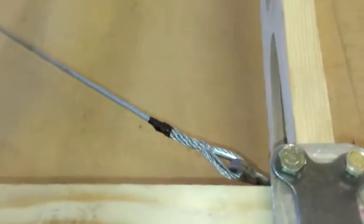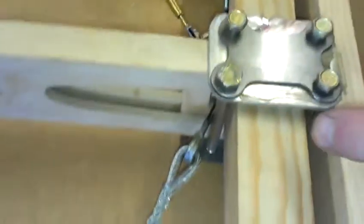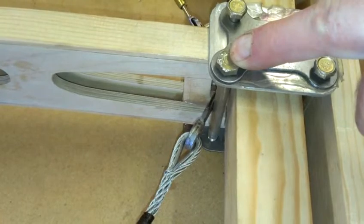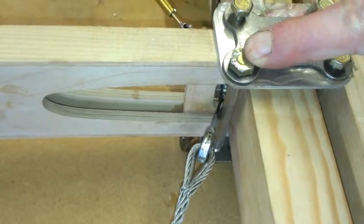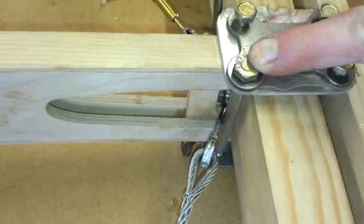The problem is worst on the rear fitting, where we've got a 5/8 bolt here which takes the drag link. Because it's offset a bit further and a bit wider, the interference is rather worse, and we really haven't come up with a satisfactory solution on that one yet.